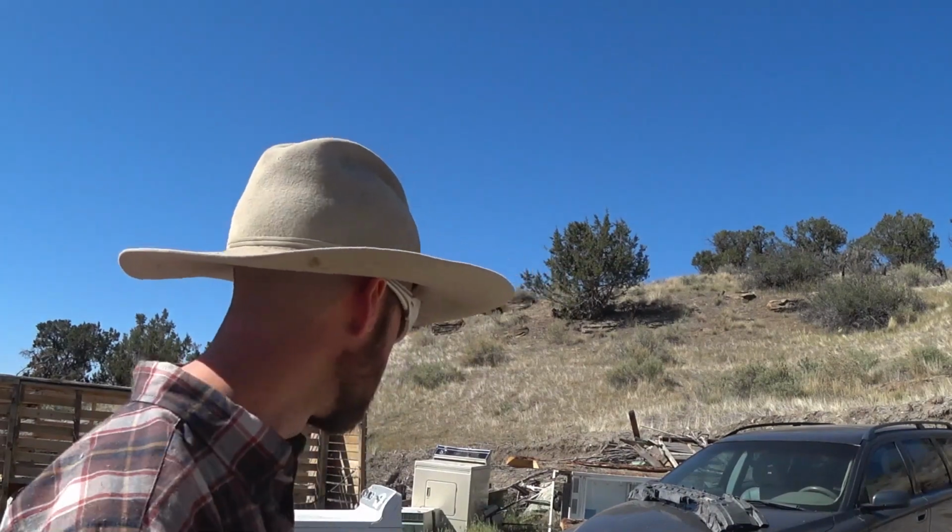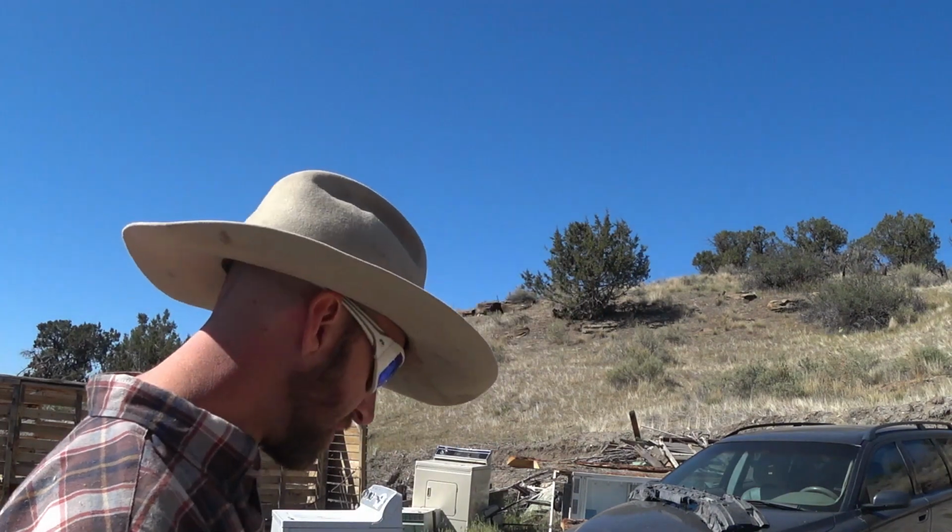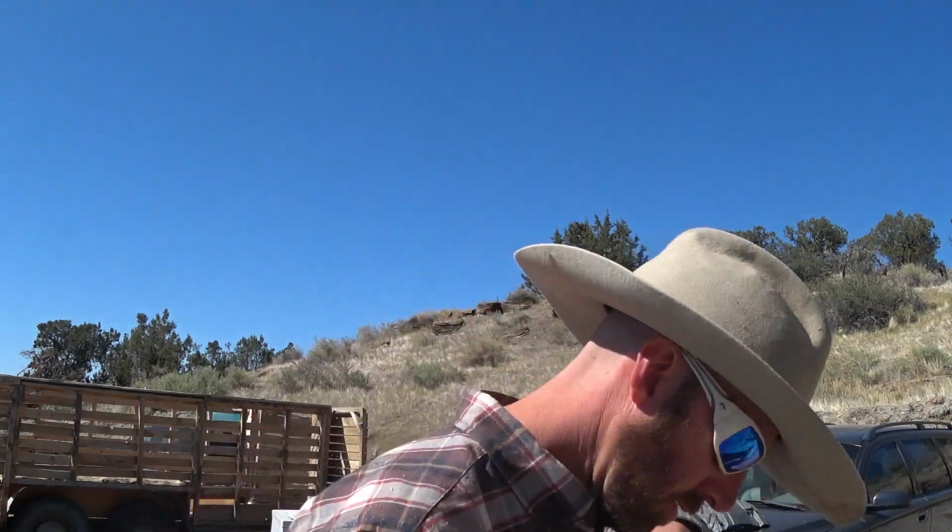We had a couple of boards that were really wide, but they were already milled at the sawmill thin enough, like 1 inch or so, or maybe in some cases 2 inches thick. So I went ahead and milled those at 6 inches wide because it's really hard to come by 2x6s. You can't mill them with this method because the blade only goes out 3, unless you want to flip the board over, which I've done before, but oh my god, it's a pain in the ass. It's a real pain in the ass. It's not an efficient way to make boards, and it's not worth it even doing it this way to save money. So we just need to measure one more 3-inch dimension here.